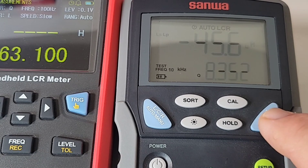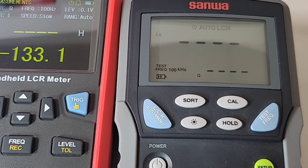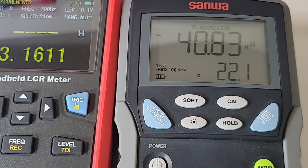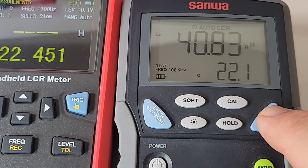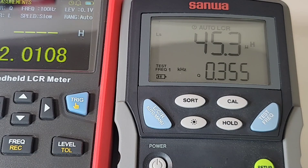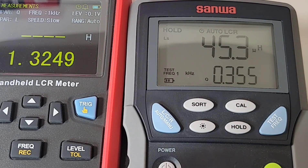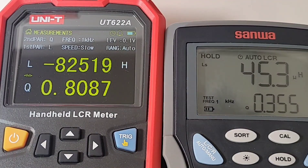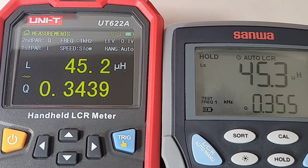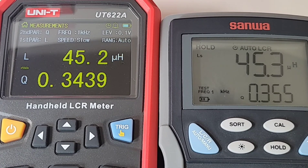I'm going to change the Sanwa to match the Unity at 100 kHz to see if the reading is any different. Surprisingly, at 100 kHz it actually dropped a few — down to just under 41 microhenrys. Putting it back to the standard 1 kHz for the Sanwa, it really prefers that. I'll hit the hold button on the Sanwa, set the Unity to the same frequency of 1 kHz, and try that 47 microhenry inductor one more time. Look at that — it's pretty well in agreement with the Sanwa at 1 kHz.